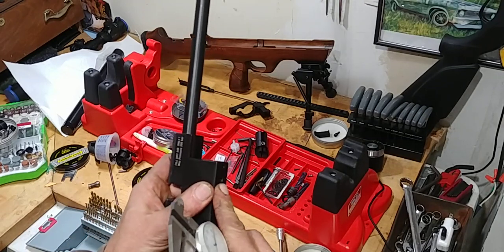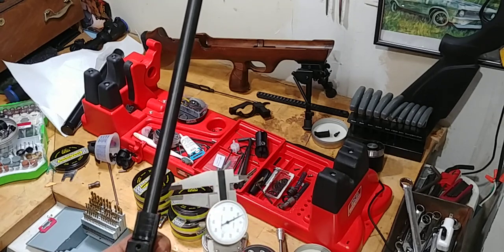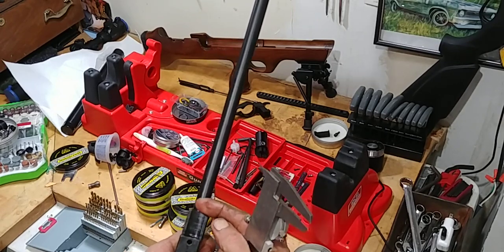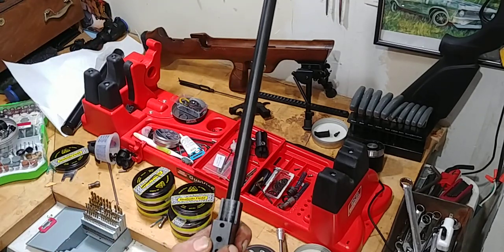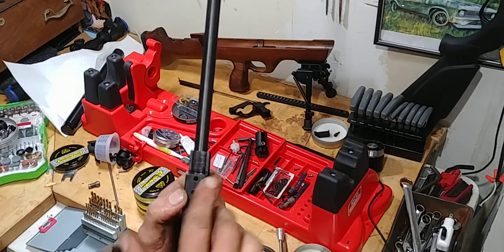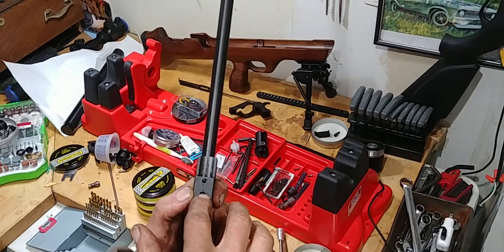Unless, like I said, and I was going to do it, but I know you want to keep 80%, trying to remember, 80% of the barrel, the width of the hole. You don't want your pellet dropping into that transfer port hole. So you have to keep it very conservative to where you will have not affected your gun, because once you do that, then your gun is pretty much destroyed. Your pellets will never load, and it'll always shave off the hole going in there. So about 195 is your max right here, unless you opened it up, retapped it, and used a bigger set screw.